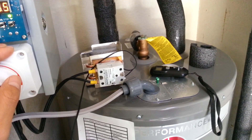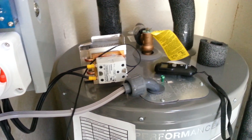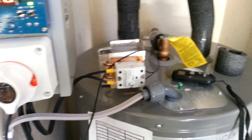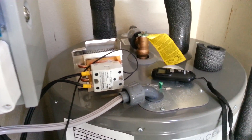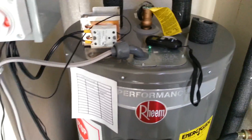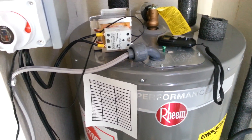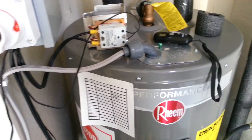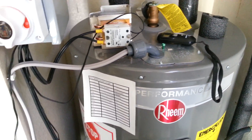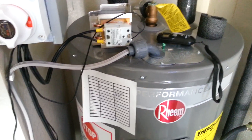For two or three people's use, every morning the tank is still at about 35 to 40°C, and it only runs for about an hour or two at 1,000 watts to get back up to 55 or 60°C, then it shuts off for the rest of the day. It's a bit wasteful but I'll keep it simple. I'm thinking about removing two panels and taking them to my other house to use on my off-grid system there.